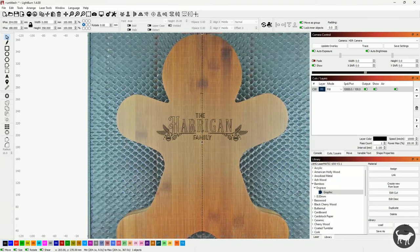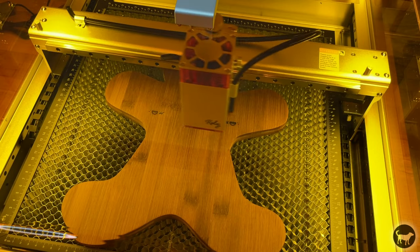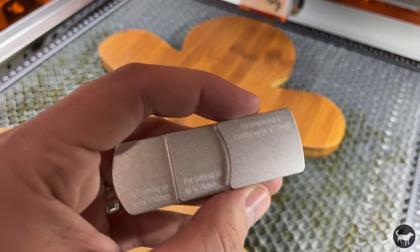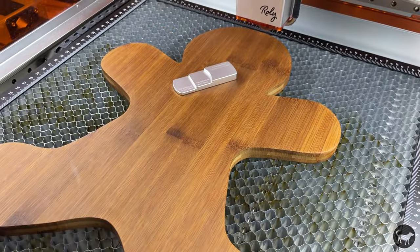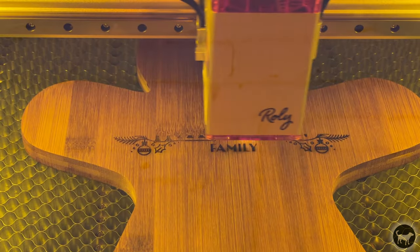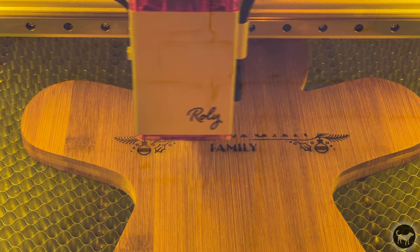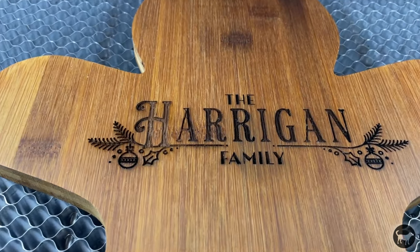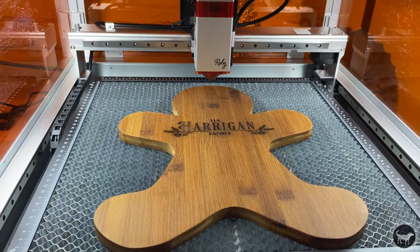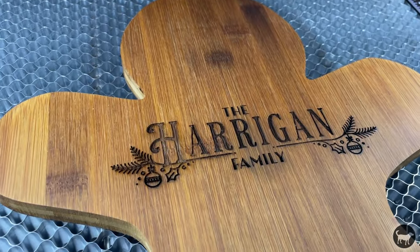I ran the camera alignment and then placed this gingerbread cutting board onto the machine. I captured the image to help me place the text on it. It did a pretty decent job and helped me to align the work pretty accurately. To set the height for the laser, you use this small wedge to measure the proper focal height. You use the different heights based on whether you are cutting or engraving, and at what thickness you are cutting. So with the height set, I ran this job at 4200 millimeters per minute at 100% power, using the 10-watt laser switch to get better details. This cutting board looked nice, but I ended up going over the design for a few more passes since this bamboo board has lots of fillers that change the overall way that it engraves. Overall, it was a good first test.